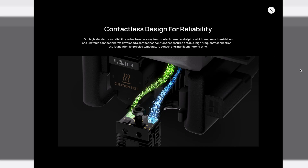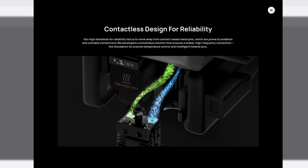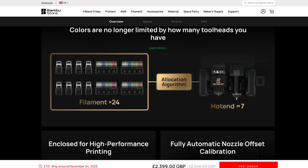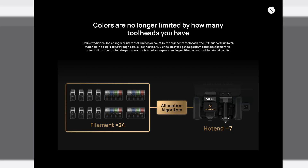There have been concerns in the past where other manufacturers use pogo pins — like the connector pins on the back of an iPad Pro — where they make contact with an accessory to transmit data and power. The worry is that over time there'd be physical wear on those pogo pins and they could become a point of failure. With the H2C, it's using induction technology, so it's basically charging and transmitting everything wirelessly to get that nozzle going. It removes that pogo pin wear point of failure, which is really interesting.